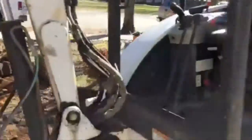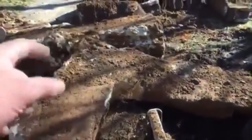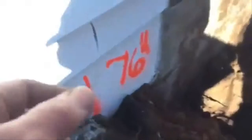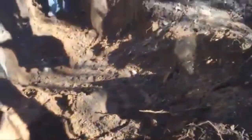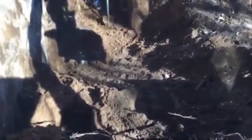We have the machine running right here, and you can see we're turning the corner. Our staircase is going to go right in this area. We just pulled out the footings — you can see the old footings of the old staircase right there. From this mark to that mark, going out with the staircase 76 inches, will be the landing and the steps. We're going to put a nice big cement pad down there connected to our footings.